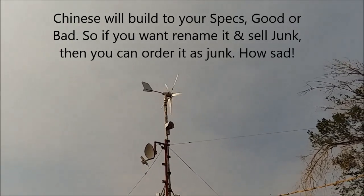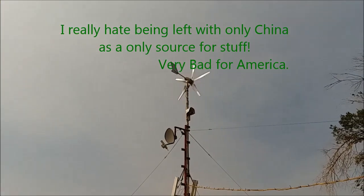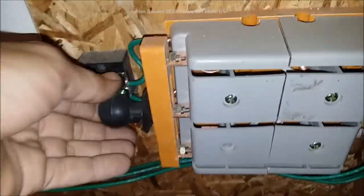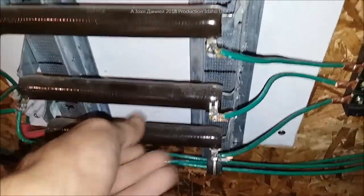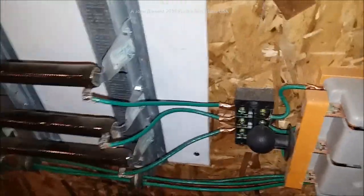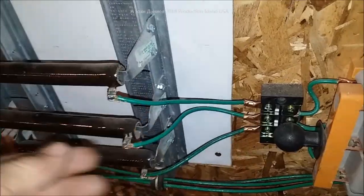Let's go look in the shop and see what my little $300 Chinese turbine does. Up on my wall I've got my resistor load wall. I've currently got the gray matter turbine — the one with the bad slip ring — feeding through resistors. I can tell I have a bad leg because the readings are warm, cold, warm. I'm feeding it through resistors so it doesn't run away with one bad contact in the slip ring.